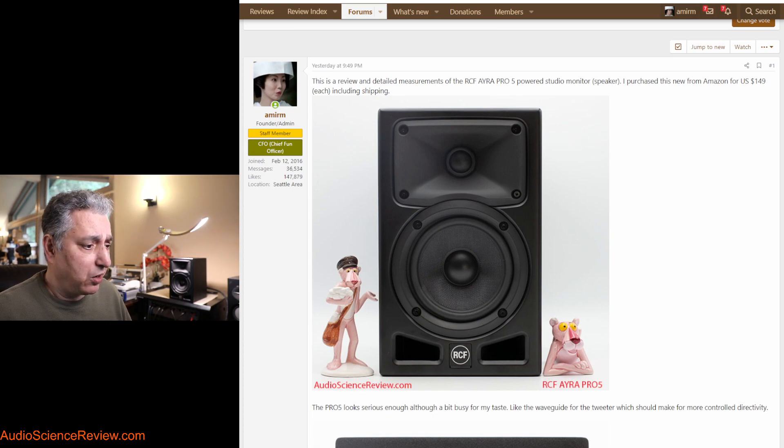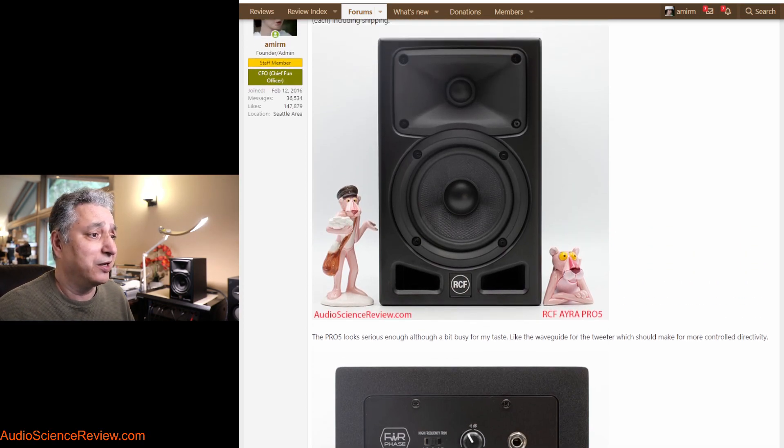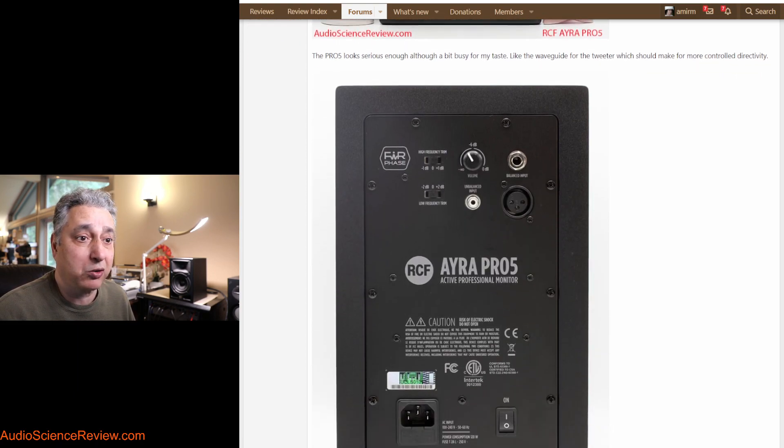It's hard to imagine how they make these speakers so cheap with so much going on in them. This is actually a rare DSP speaker — it's bi-amped, so all the signal processing for the crossover is done in the digital domain, as is some correction for the frequency response. Usually lower-end powered monitors just have an analog crossover and no DSP, so to have that at this price range is quite remarkable.